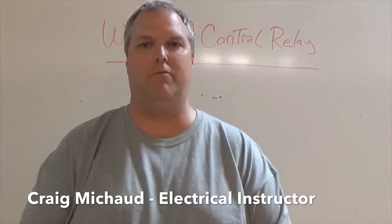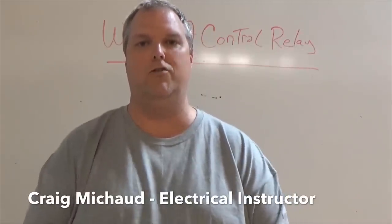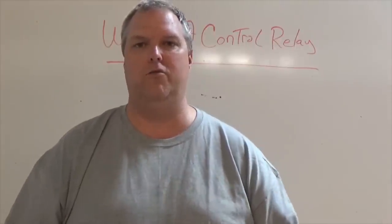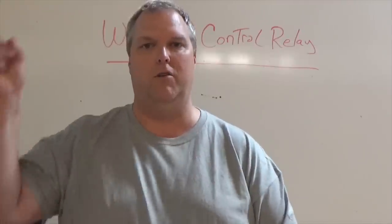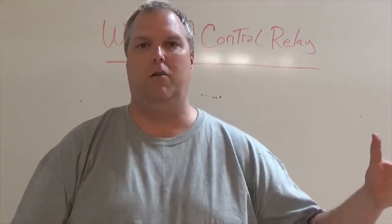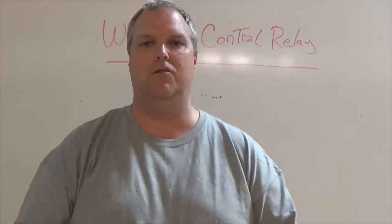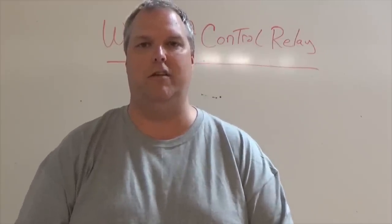The biggest thing that we have to remember is: is it a 24 volt control voltage or is it a 120 volt control voltage? The one we're going to use today is 120 volt control voltage. What we're going to do is use our start-stop station that we wired in a previous video, which I believe is up here somewhere. We're just going to drop this control relay in, basically taking the 8-pin relay out, and I'm going to wire up the control relay so that you can see how they work. It pretty much works the same way. I'm just going to show you in a demonstration.